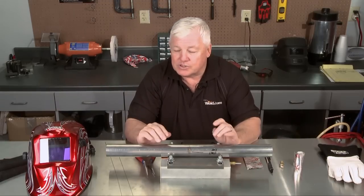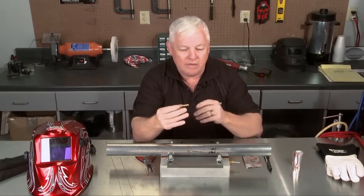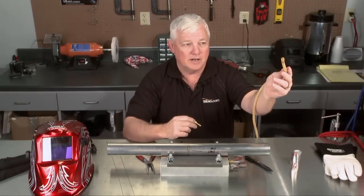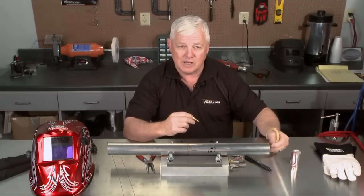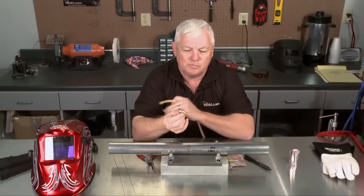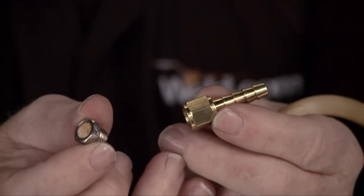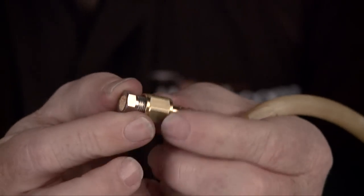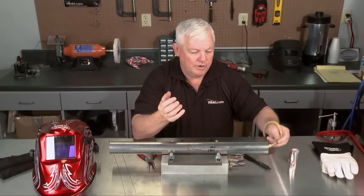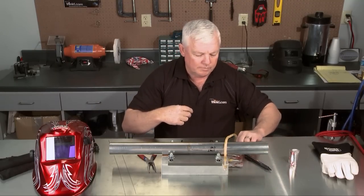In order to purge this out, you can use some very inexpensive devices. Rather than insert just a tube of argon — we've got the argon set at about 10 to 15 CFH — rather than just put the tube in and tape it off, I want to diffuse that gas. So in order to diffuse that gas, I purchased a little device here. This is a little brass barb that you can get at any hardware store, and this is a little purging device that's really a muffler. I found that at one of the tooling supply houses, and my total investment on this is only about $4.